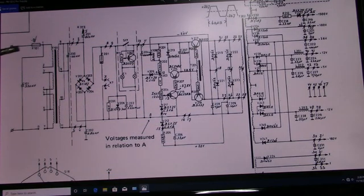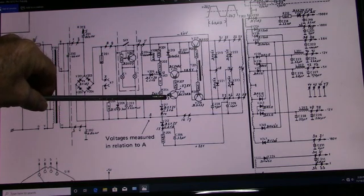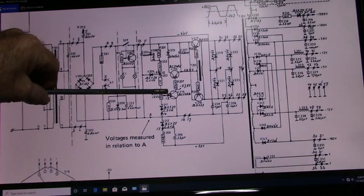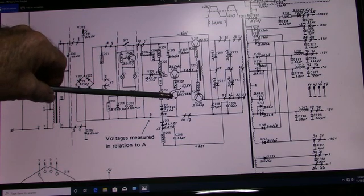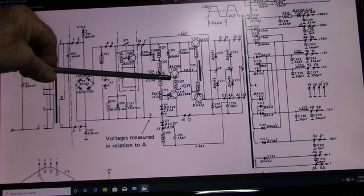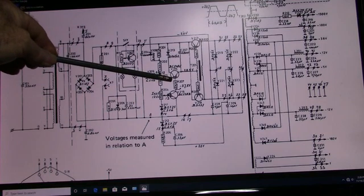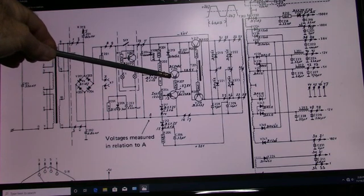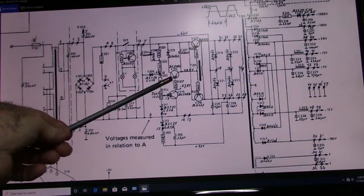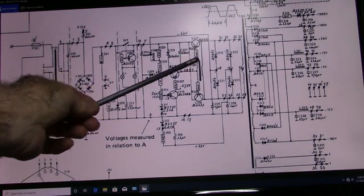And the way this works is, once you turn on switch S17, you supply negative here, and you get a negative voltage down through this divider. This turns on V216. This is a PNP transistor, so the negative voltage turns this transistor on, and that supplies a positive voltage up through the transistor to the base of V214. Now the collector is blocked by this diode, so you're basically using just the base-emitter diode as a diode, and since the base is positive, it's forward biased, so you're applying a positive bias to both bases of these transistors.